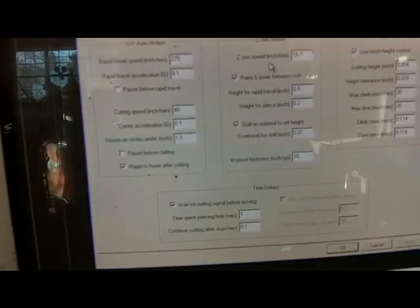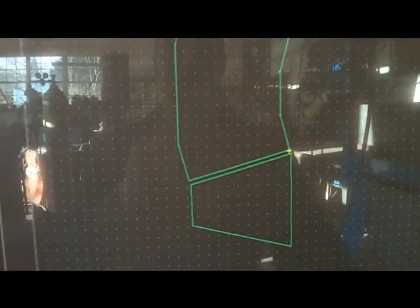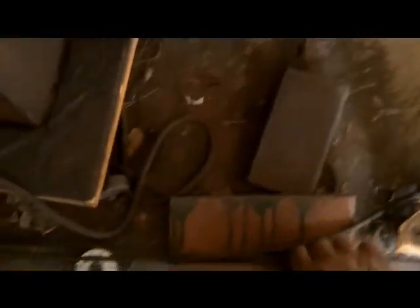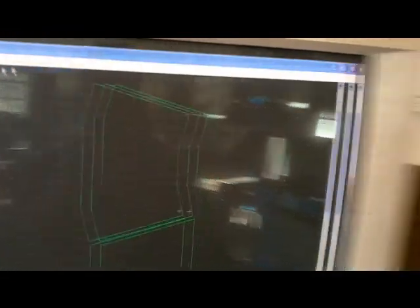This piece will be added on after — it's just too hard to bend in the brake. It's a little awkward shape so it'll have to be bent in two pieces. We're going to have a cap. Here's what I've got so far on the plasma cam — that's one piece and that's the cap. I've changed my settings to 16 gauge and my travel speed to 140. I've got a little foot switch here for the fan, just put the angle iron on there, everything's good to go, and we'll see if it cuts with no issues.